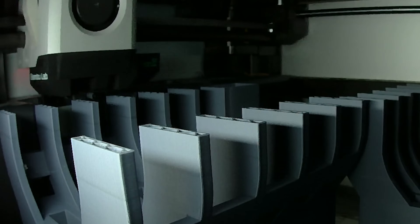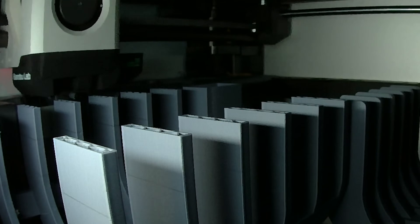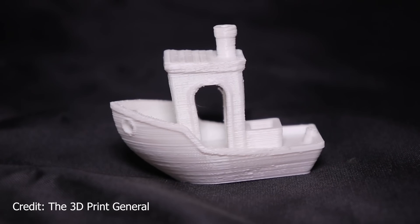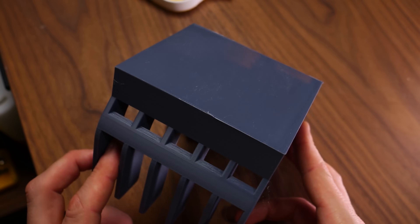Because the veins stick up so high on the larger model, this is also a phenomenal test of the belt tension and stiffness on your 3D printer, not to mention helping you identify if you have any Z-wobble caused by a bent lead screw. Basically, because of the tall, pointy bits on this print, it's great for diagnosing whether you have any issues with Z-banding, which causes ribbing or bending on long, tall prints. Finally, this print has large square surfaces with 90-degree corners, so you also have a fantastic bed adhesion test juxtaposed with the cooling test of the upper layers. If your corners bend or warp, you either have poor bed adhesion or you need to turn down part cooling during earlier layers, or both. Four different aspects of 3D printer performance and knowledge tested in just one super functional part.